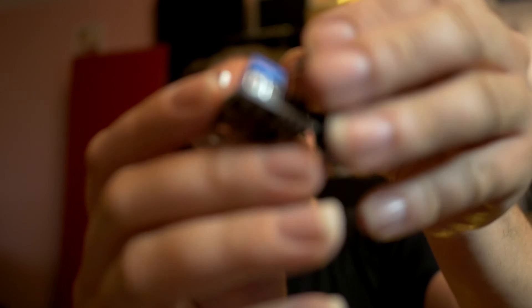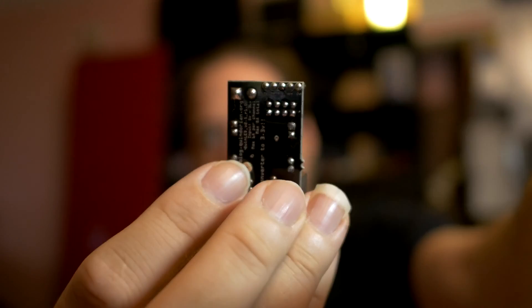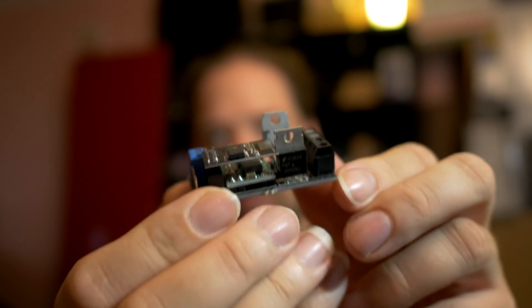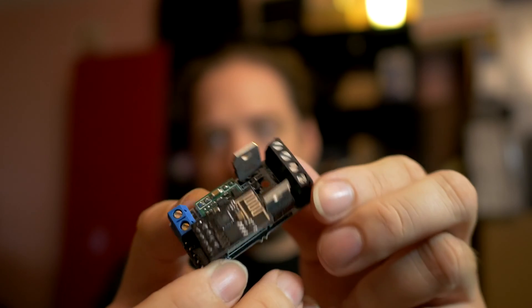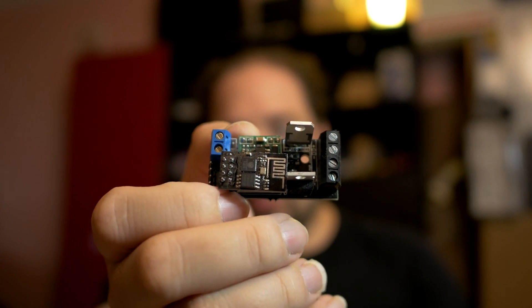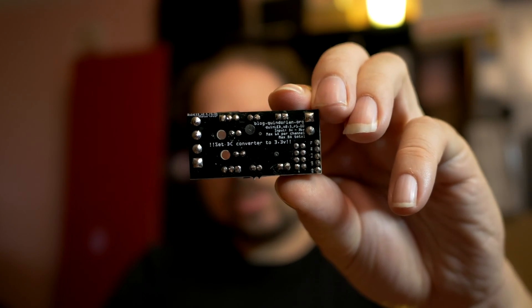The PWM frequency is set to 1000 Hertz. Let me plug in the microcontroller for you because this board is a version 2.5 revision 1, but there's a bit of a snafu with it. As you can see, the microcontroller basically hits one of the MOSFETs. So I've made a new revision and sent it off to the board house where the MOSFETs get placed a little bit to the side, and that should fix it up pretty nicely. When that's done I'll share that revision online.